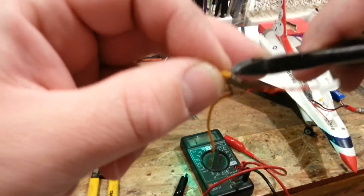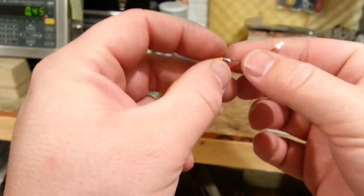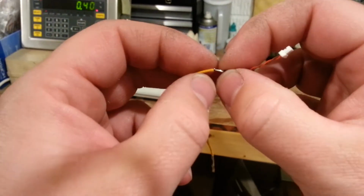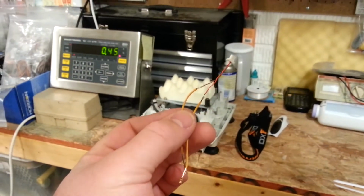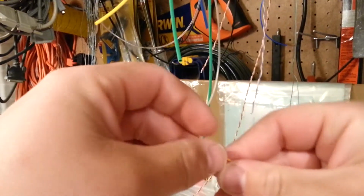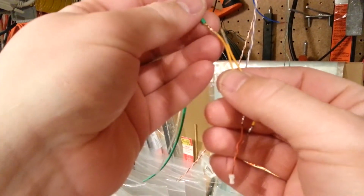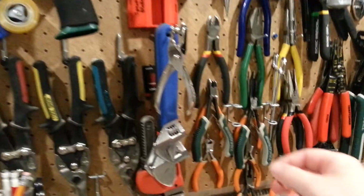And you know, you don't want to have to figure stuff like that out. You want to be able to assume certain things are just right from the get-go. So now I'm going to put a little heat shrink over here just so I don't break these connections. Even if I end up soldering it on, it doesn't really matter. So you just have to have a piece of heat shrink that's a little bit bigger than this connector, so these green will work. And there's hardly any needed there, so we'll clip off a couple of short chunks of that.